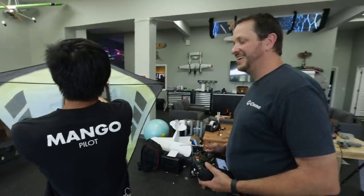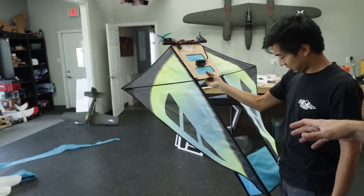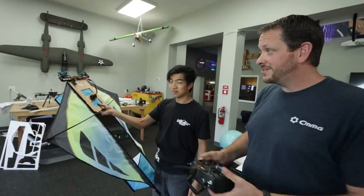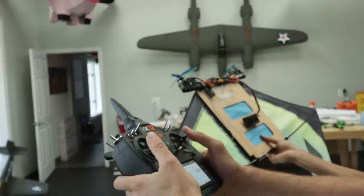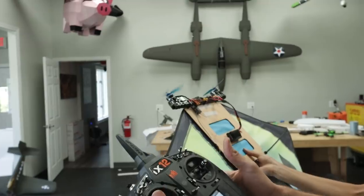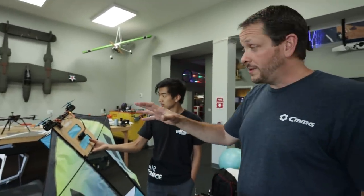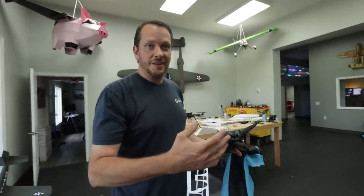Oh, that's cool! We're testing our motors here. Dude, that looks awesome. We're about to go out for the first test flight — no control surfaces, just two motors, two tough tilts, and two servos to tilt the motors. If I want to go up, I pull back and it pitches the nose up. If I want to bank right, it banks right; bank left; and then differential thrust for the rudder. Most RC kites I've seen use pushrods and control surfaces — I want full control through just two motors. And I really don't want to destroy this kite — my wife got it for me as a present at Myrtle Beach, so it's special to me.